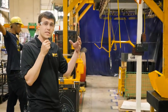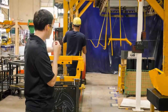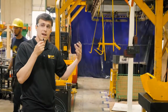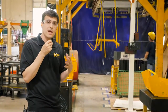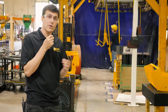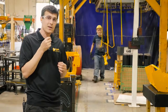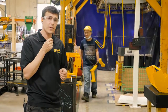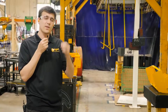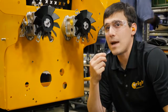So now that the steel has cooled down, the powder's cured, we unload the parts. So here we unload all the parts of the mower, and all the parts get divided up and sent to all the different areas within the assembly department. Right off the line, straight into assembly. We try to let the mower never cool down in the process because, again, it's all about that mower not sitting idle. As soon as it sits idle, something gets forgotten, something gets lost, something goes wrong. You want to keep the mower moving, gives the best quality and the best costs we're able to give to you.